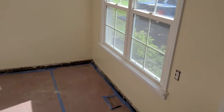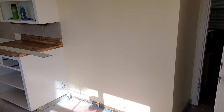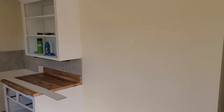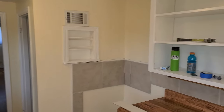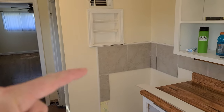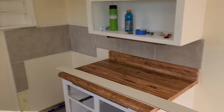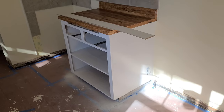All the wall painting is done. It's kind of hard to see with the sunlight coming in the window but it looks good. That wall right there — biggest wall in the room, took the most paint. The crappy thing is that wall is going to be behind the refrigerator. But I know it looks good. Everything's done, two coats. I'm going to have to touch up a little of the white but I'm going to wait until I get the baseboards in because I have to paint those as well. I also have to do some toe kick, but I don't have a table saw with me right now to rip it to height.